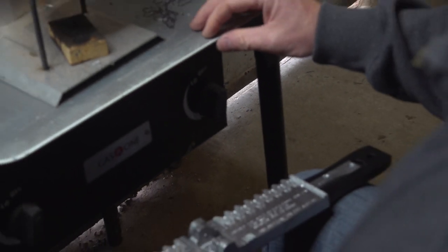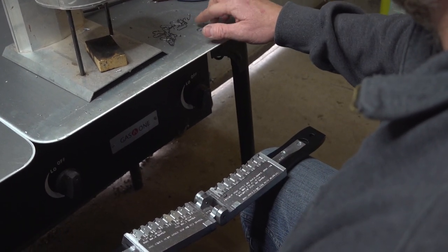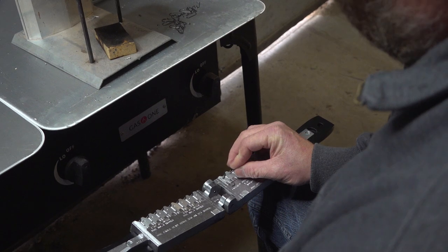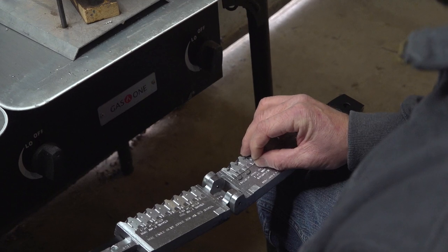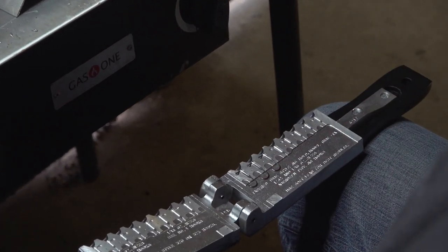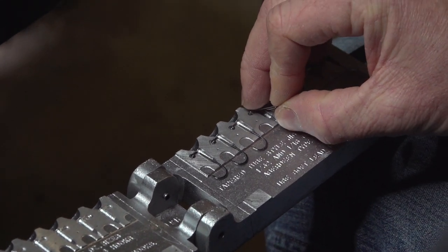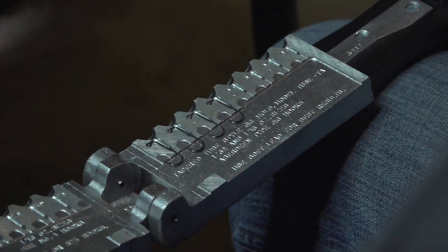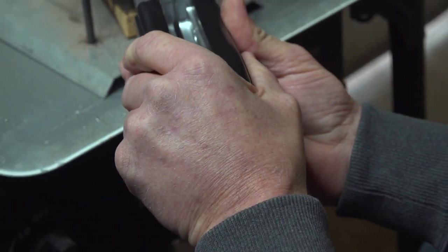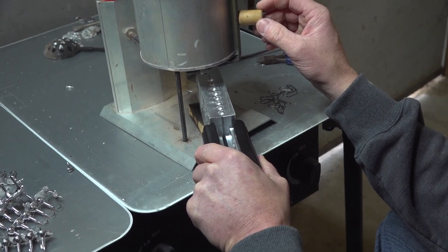The lead for these, you can get in several places. You can shop around online, and because these are jig hooks, you don't necessarily need really soft lead. As a last resort, if you can't find any from a buddy or a friend or online, go to any tire store and ask them for a 5-gallon bucket of wheel weights. They'll usually do that. Even though wheel weights are a little harder, dirty, and have a lot of zinc and tin in them, in a pinch you can use wheel weights as lead as well.